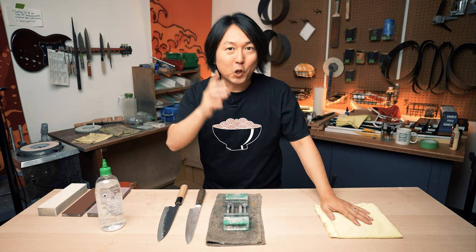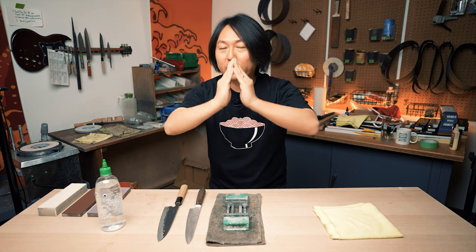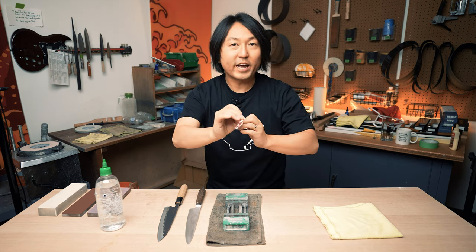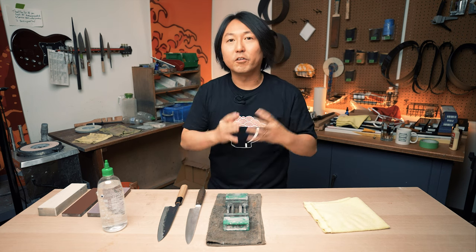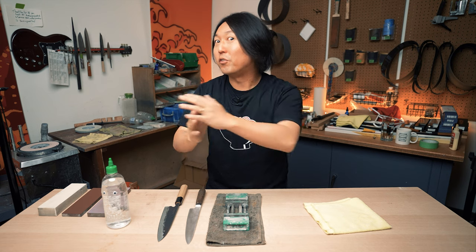Just want to point out though, no Japanese knife makers are trying to make these perfect straight flat angles. Almost all those knife makers are trying to make at least slight convexity, just because it gives you a little bit more toughness around the edge. This balances out the fragile nature of Japanese knives or the Japanese steel. This type of grind is called Hamaguri grind. Hamaguri is named after this very popular and tasty clam from Japan. They call it Hamaguri grind because the nice little convex grind resembles that shellfish.